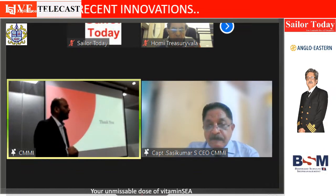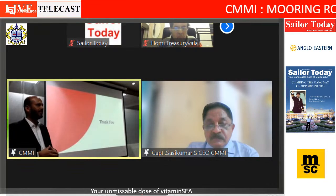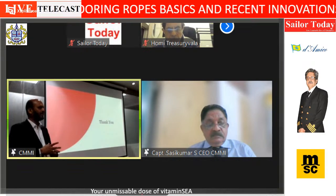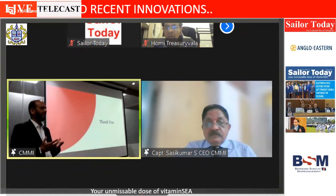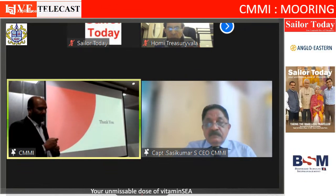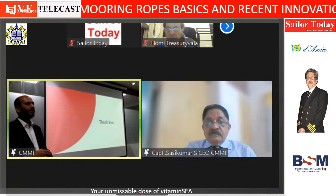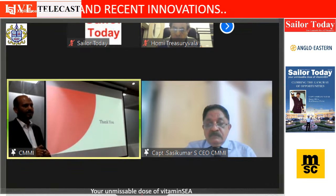Okay. Great. So Dyneema is a brand name of DSM, now taken over by Avient, another US company, originally a Dutch company. And Dyneema is a brand name for HMP fibers. HMP is high modulus polyethylene fibers. GARWARE has a brand name called Platina. Samson Ropes has a brand name called Amsteel Blue. So everyone has its own brand names. The ropes are essentially the same diameter as steel wire and the same strength as steel wire. The elongation is also the same as steel wire. But the weight is only 1/7 of a steel wire rope.